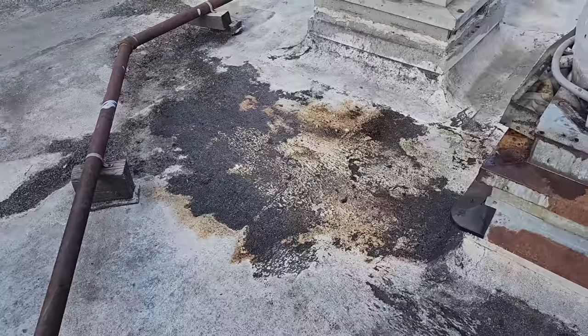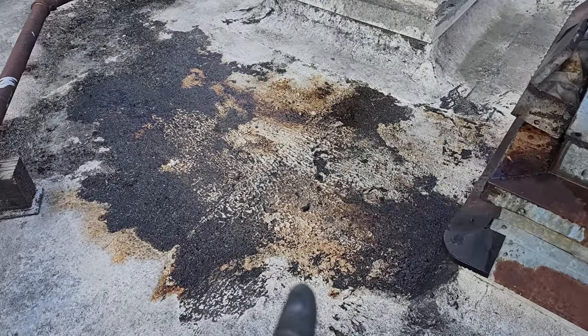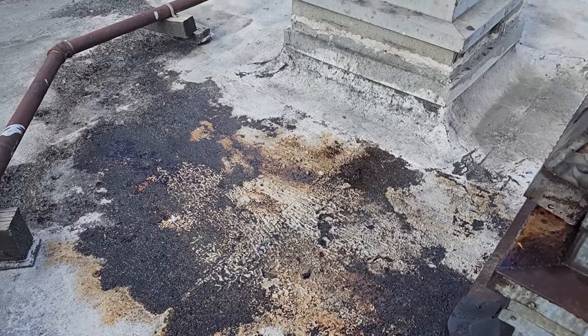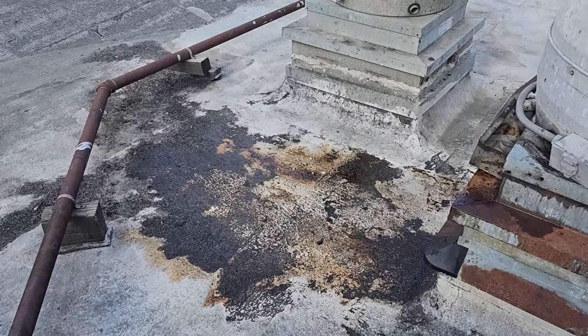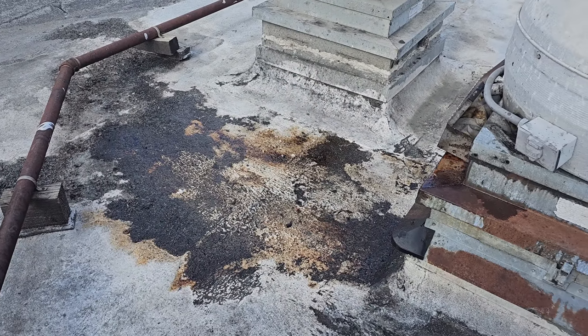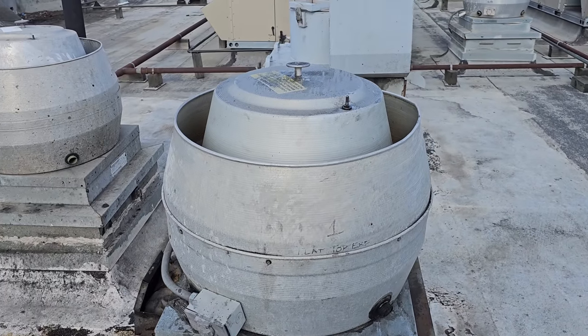damage from the grease. That grease, it will eat the roof away. Clearly, you can see, it's like paint stripper. It's stripping away the paint that they have on the roof. They put some like white epoxy coating or something on there. So they're gonna need to solve that problem. So we'll bring all this information up, we'll bring back the spare belts, and we'll go from there.